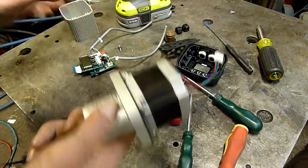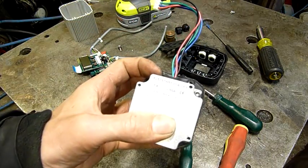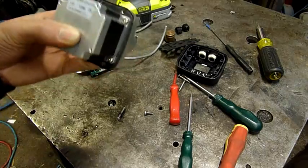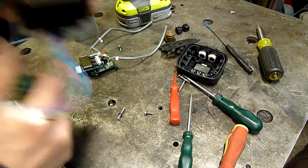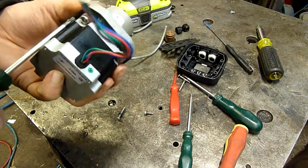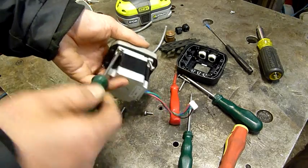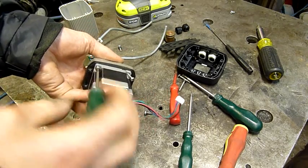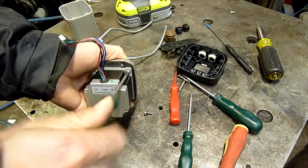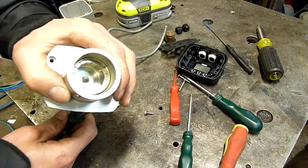The heat sink is just a bit of extruded alloy, and that's just a photocopier-grade stepping motor by the looks of it — 1.8 degree step, pretty straightforward. The end of the shaft there is crimped or pressed on, so I don't know how I'll go getting this out unless it's keyed into it, which would be nice. It might be hard for them to crimp onto it without hammering the crap out of the end of the shaft, so maybe there is a key.